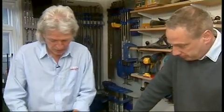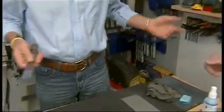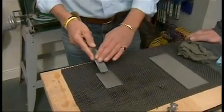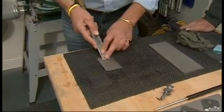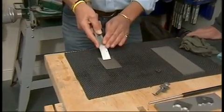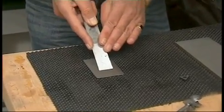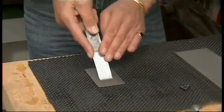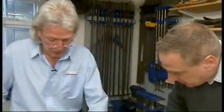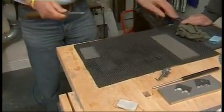So then also, as I was saying, if you're out on site, if you'd just like to pass me a chisel. Again, if you're out on site, I have to get my glasses on for this one. All right, come in here. You can see when you're on the right angle. And all you're doing in a very light motion, it cuts forward and back. You can see exactly what I'm taking from that. You can hear it cutting, can't you? Edge already. Absolutely remarkable. And then obviously flat on the back and just take off a burr.